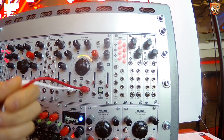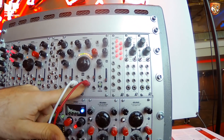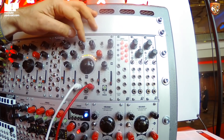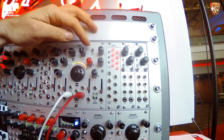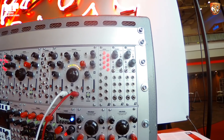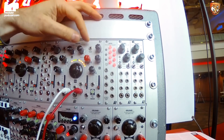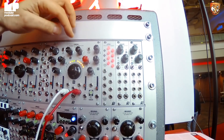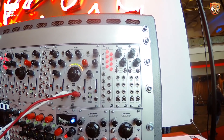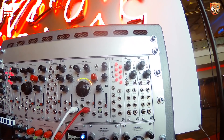You have two individual outputs for even and odd harmonics, and the third one for the fundamental. With these two knobs you can divide them into groups of different lengths. With this one you can change the divisions or multiplication of the frequency in the groups, so these two can work for a stereo effect or just like two quasi-different wave shapes.